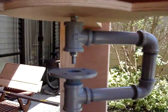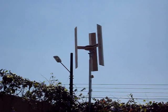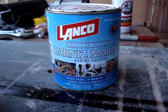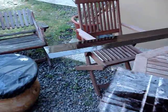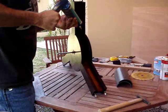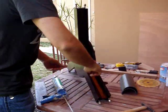I got it up on the pole and tested it out - it did pretty good. On my last wind generator I had used fiberglass resin, but the problem was it cracked when the wings flexed and allowed water in. This time I'm using a spar varnish with UV protection designed for exterior wood. I stained first, then applied the spar varnish on all the wood pieces. I also used clear silicone on all the seams and on the plywood edges to make sure no water could get in. I did this all the way around the hub assembly.